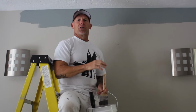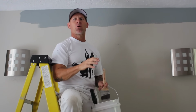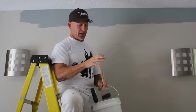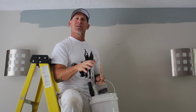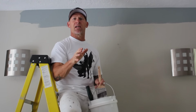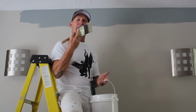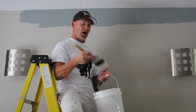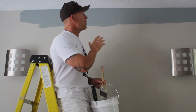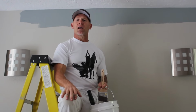So part of the process of getting good ceiling cut-ins is having the proper equipment. In a couple of my previous cut-in videos, I've shown you some of the products that I use, the brushes I use, the buckets and screens I use, so you can go back and check out those videos. I'm not going to go into depth about them right now, but I'm using a 3-inch angled sash Purdy Clear Cut brush, and it's a stiff bristle brush because I'm using a really thick paint right now.